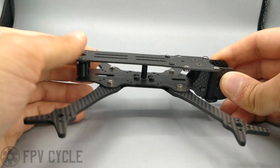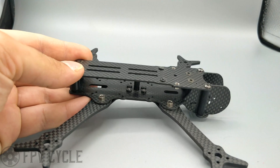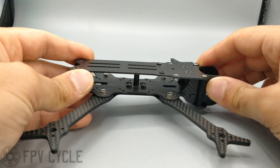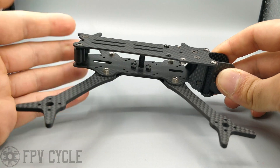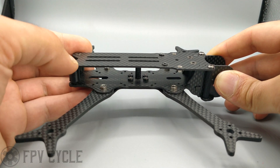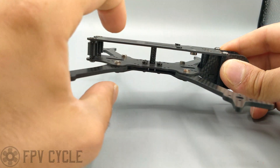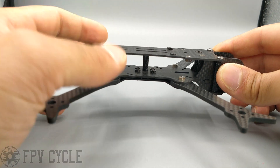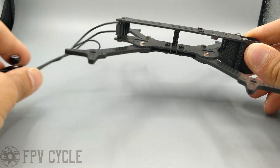For a freestyle frame with a top mount battery, you really won't tolerate anything but a top mount battery, and I wanted to bring that battery as low as possible. There is one effect where if you bring the battery and the GoPro down right at the prop level, the quad just kind of feels dull. My theory is that the thrust coming off the side of the prop disc is running into the battery and camera, making the prop feel like it's in a more static environment — so the motors and ESCs have to work harder. You really want flow through the frame, with your prop line just a millimeter above or slightly below the top plate. The motors are really flat and lend themselves to that nicely.